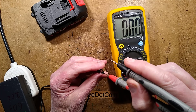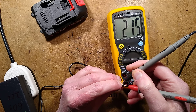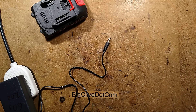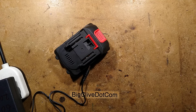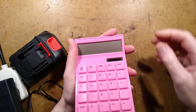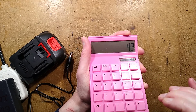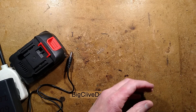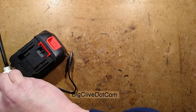Technically speaking, the cells themselves — the battery — should cut off when they reach their full voltage. But this goes up to 21.5 volts. That's reasonable enough; it's a good enough voltage. If we have the classic 18-volt pack with 5 cells, they could theoretically charge to 4.2 volts each — times 5 equals 21 volts. There's also a diode in the battery pack, so maybe it doesn't quite get there. Slight undercharging is good.